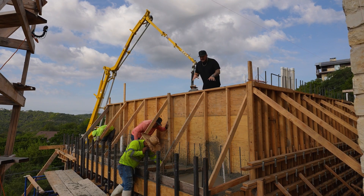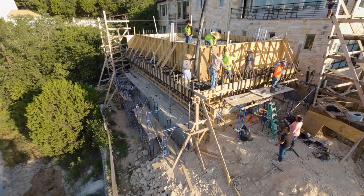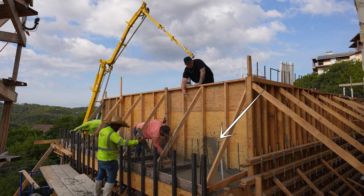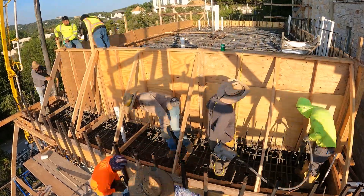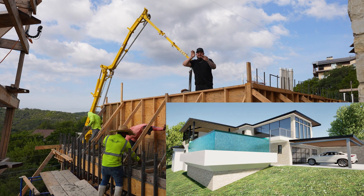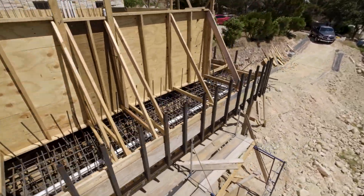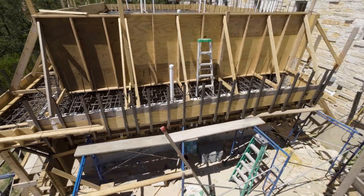What you're seeing right now — the guys down here — this is the platform that our catch basin is going to sit on. You see those rebar dowels right there. We're doing that because our next wall for the pool, when our pool contractors come out and form the shell, that wall is gonna come up and overflow down into the catch basin. This is gonna be a U-shape down here, and we have pipes — you see all the PVC — so all of this can continue to recirculate through our whole entire pool.